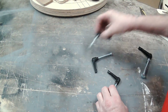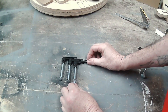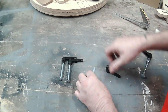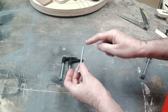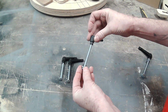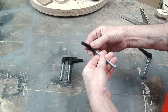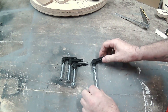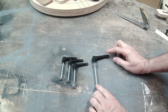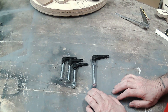The last things we need are some locking handles — again these came from Amazon, I'll put the link in the description. These are little ready locking screws. The important thing is you need to make sure your bolt is exactly the right length; I had to cut these to suit. And the last piece is the M8 bolt — that's the main locking screw that holds the steady rest onto the lathe.